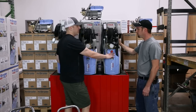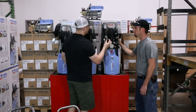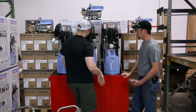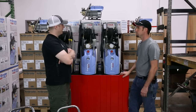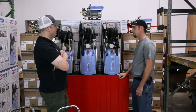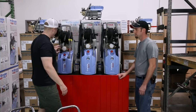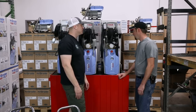Both the 2017 and 2020 also use a 3.0 nozzle. As you increase the horsepower of the motor you get that extra boost in pressure and flow. In my perfect world, Kränzle would offer this 20-amp application with the magic black box and a different wobble plate to get me high twos or low threes in GPM. My real-world testing shows about 950 PSI at the gun on the 1122 with drivetrain and hose losses, getting around 1.8 GPM on a 1400 PSI-rated machine.